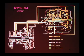A pressure rise is experienced because of the regulator spring resistance, causing the reverse lockout spool to be pressurized. When the reverse lockout spool is pressurized, the spool tang is engaged with the slotted area of the selector spool, and the spool land position permits completion of the C1 pilot actuator circuit. When the pressure in the steering return circuit reaches the regulator setting, the regulator opens and dumps the excess volume into the clutch lubrication circuit.